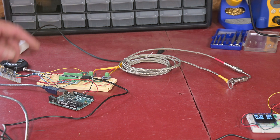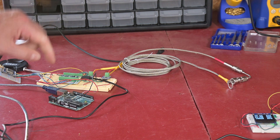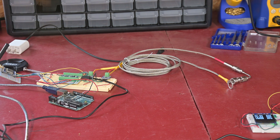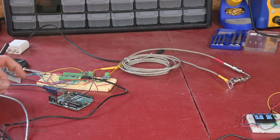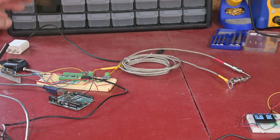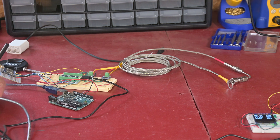When I was writing software for it, I wanted to be able to mimic the RPM even though I am not doing RPMs today. I got another microcontroller that is sending pulses into this so I can transmit the RPM out to keep the packets consistent. Even at 10,000 RPM you are only looking at about 160 to 170 hertz signal, which in the world of microelectronics is pretty slow. I am sending it at 166 hertz with a 10% duty cycle, figuring that is the kind of pulse we are going to be getting off the engine.